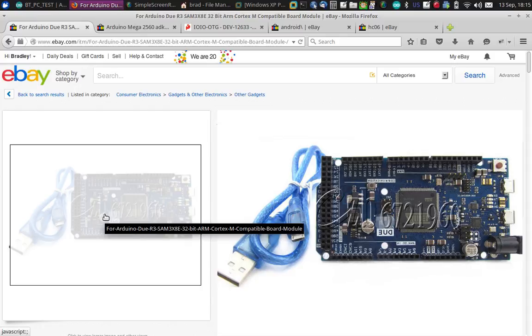So it has everything that the other boards have, except this is the only one with a digital analog converter. It has two of them: GPIO, analog input, UART, SPI, and I2C. And it has two USB ports. One's connected to a smaller Atmel microcontroller, which does the in-circuit programming, and it's a serial port for programming and debug messages. And then the other USB port is connected directly to the Atmel OTG pins, which can behave as mouse and keyboard and whatnot. It can behave as USB host or USB slave, I guess, and so that's nice. But it can also act as an ADK.